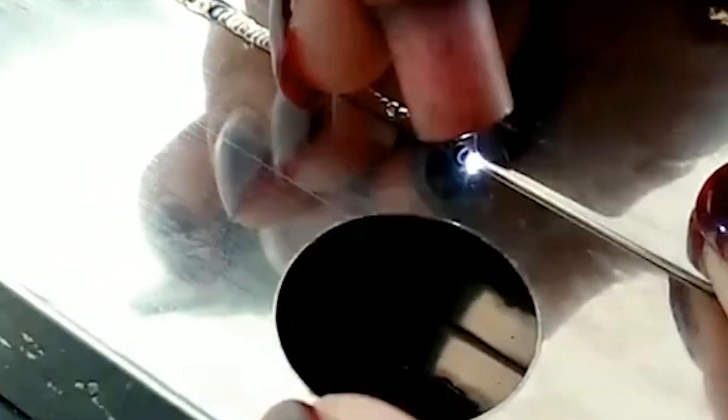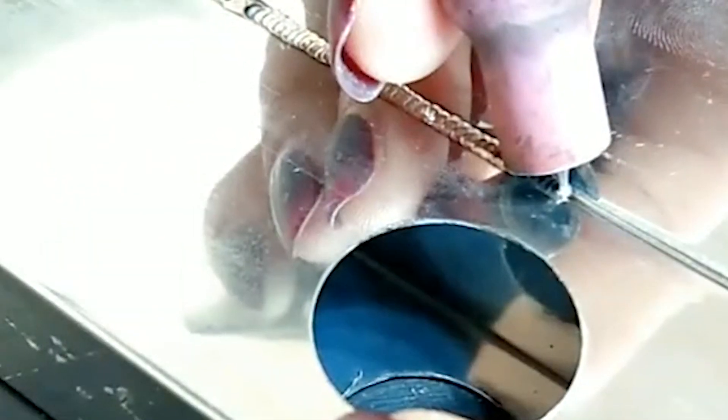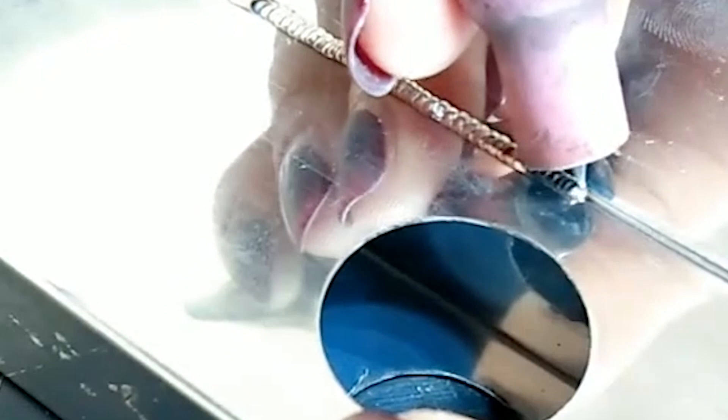The third point is the difference in the brightness of the welding spot and weld bead. The weld bead of the cold welder is white and bright and will not turn yellow or black after welding like the argon arc welding machine does. This eliminates the tedious procedures of grinding, polishing, and waxing the weld after welding.